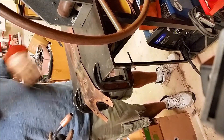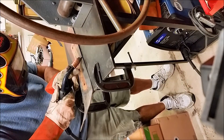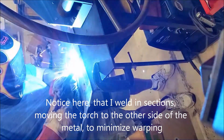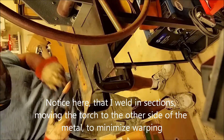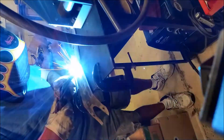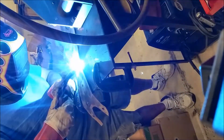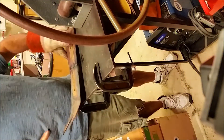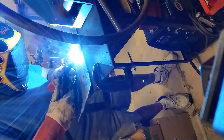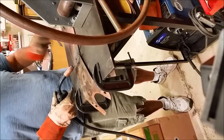Tacked in three places. Now I'm going to run a bead across it and maybe do the other side. To fill a hole, you basically just start at the edge and keep going around in little C's.